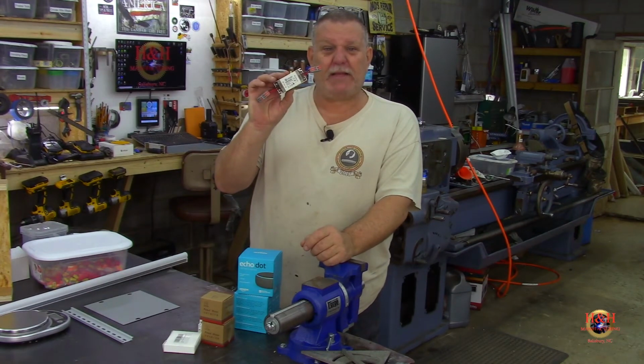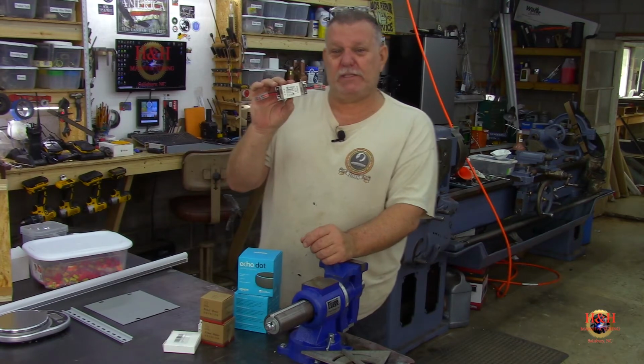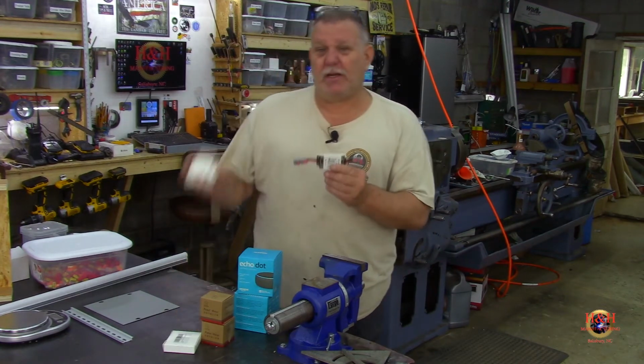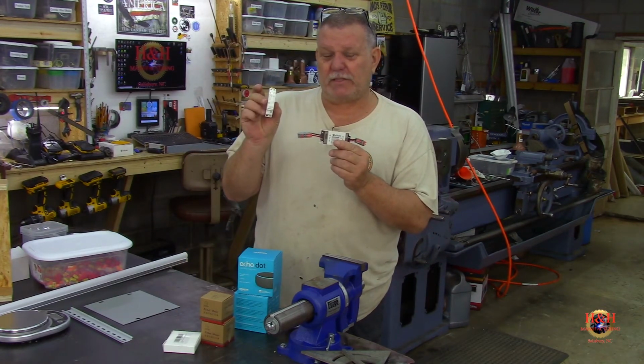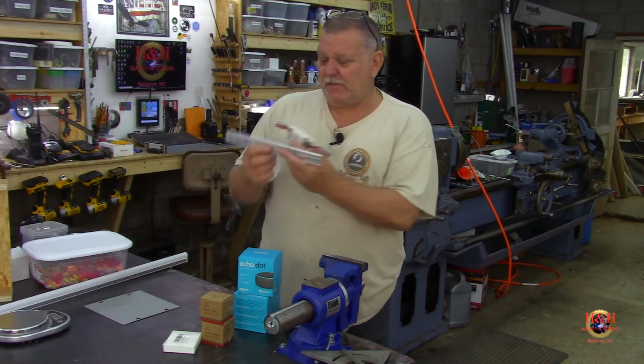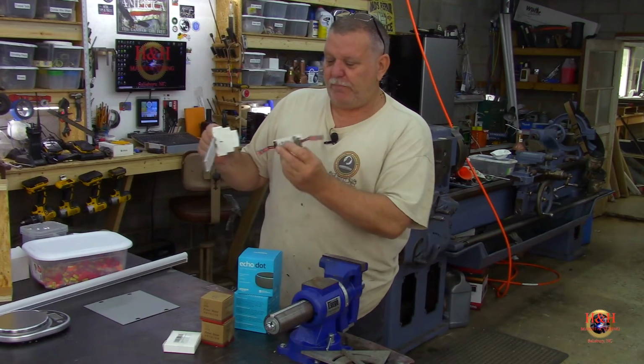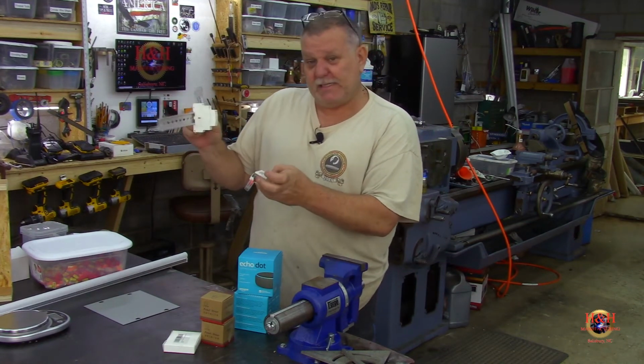But in the back of the shop, I'm pretty sure we're going to be over 10 amps. So what we're going to use this relay for is to switch a contactor. This is a 25 amp contactor. It mounts on a DIN rail, like this. So you'll mount this inside the box. This just clamps onto the bottom of it like that. This is inside the panel box.